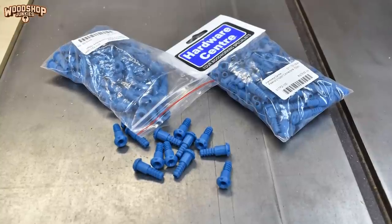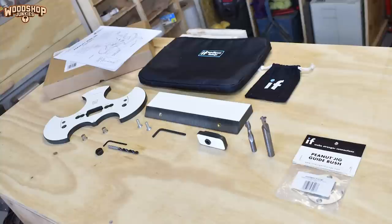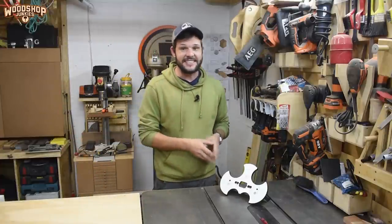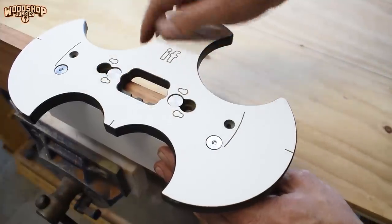As for the peanut joining system, well, it's an interesting concept and it could potentially be a game changer in various applications like off-site manufacturing. On the slightly more negative side is all the additional hardware required that the user needs to keep track of. And when you pair this with a setup which is not exactly straightforward, I would say the Jig is not super user-friendly. Or maybe it's just me, but I can imagine it being really easy to make a mistake when using the Jig. Something as small as a gravity stop in the wrong hole will completely misalign a joint.